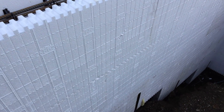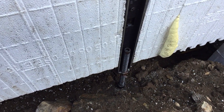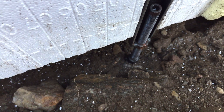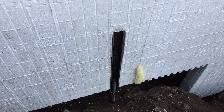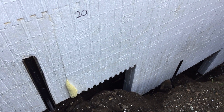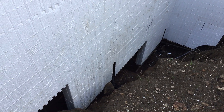These feet are pretty incredible — they have an adjustable top so I can put an allen wrench in there and adjust them up and down. That lets me really fine-tune the level and plumb of the blocks when I first set them. And you can see my ICF step down into that hole — the pit of despair.